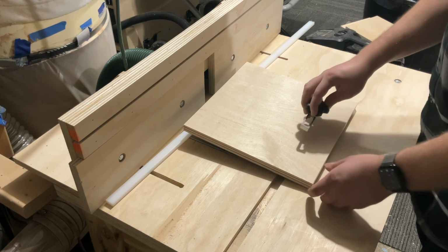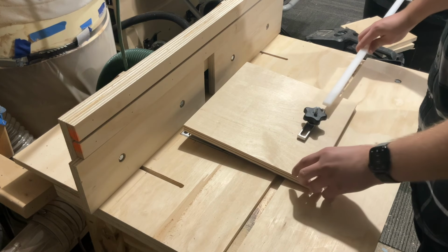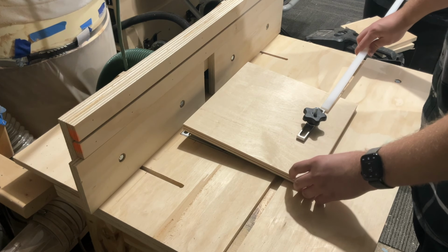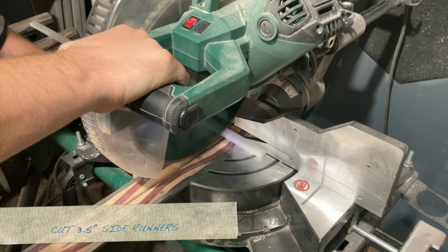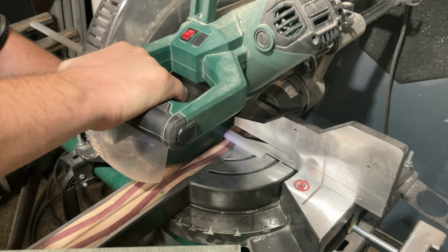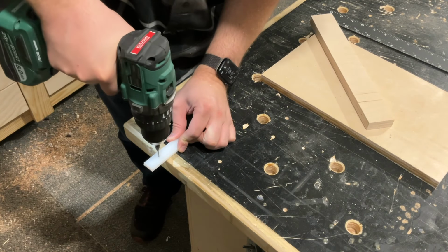To keep the jig in place, I'll be using this miter bar knob clamp thingy, and then also these miter bars. I'll have links in the description for these. But I'm cutting 3.5-inch side runners. These are just to span the gap from the clamp to the edges of the jig, just to help keep the thing squared up.